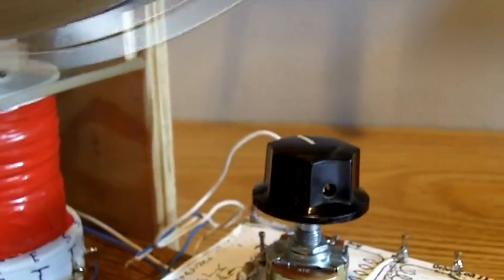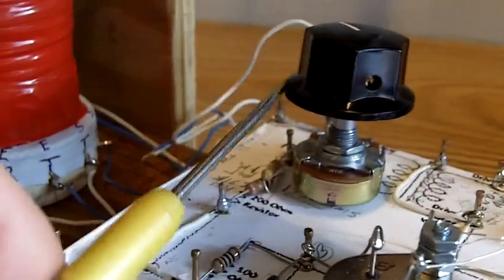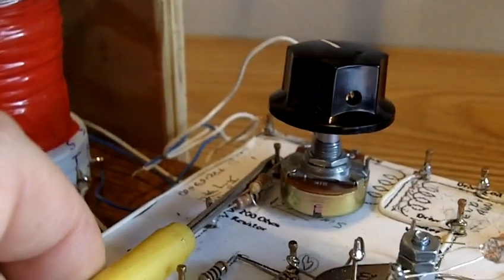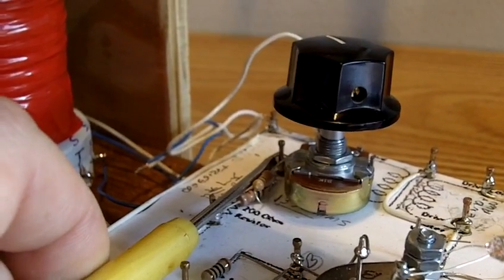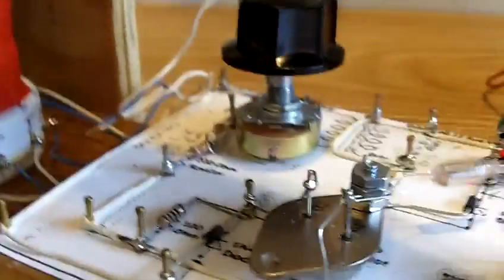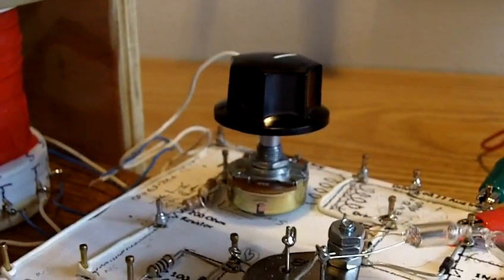Now the pot's all the way up and I've got 2,310 ohms on it. What I'm going to do is take a little screwdriver and short out the two fixed resistors — the 310 ohms right here. Can you hear the speed pick up? It was running about 180 RPM; now it's going to go all the way up to 250. Now I'm going to remove the screwdriver and turn the pot all the way down, so now I'm running on just the 310 ohm resistors. The pot's zeroed and my speed has come up to 250 RPM.